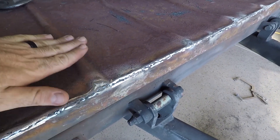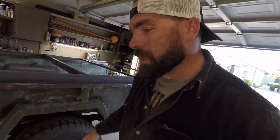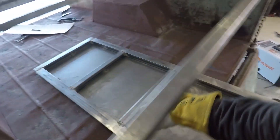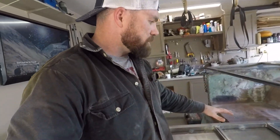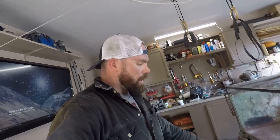I also — I don't know if you noticed — but I ground these back where they were kind of beveled, and then filled that in with weld just to give it a little cleaner look. The bed liner is going to more than likely fill up a lot of the voids. Then we have the — dun-dun-dun-dun — tailgate, tongue-gate. Just kind of spot-welded all around and throughout. Let me flip it over. So that's what we got. I was just going to do two center posts here, just like it is on the back side, but it just didn't seem like that was really enough to frame it out properly. So I did three, so we had some good support on the tailgate here. When it's down, you can put crap on it and not worry about the sheet metal bowing.